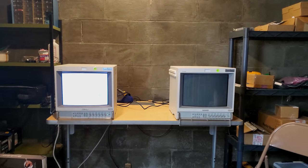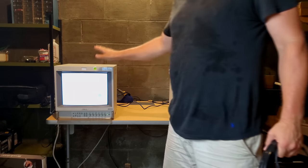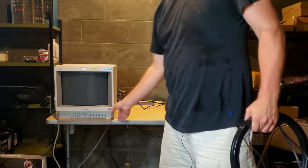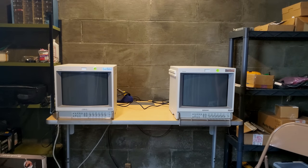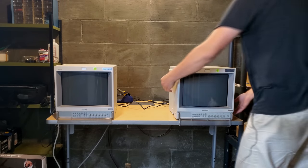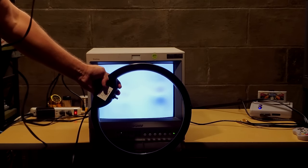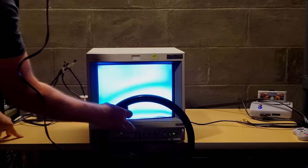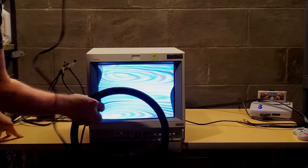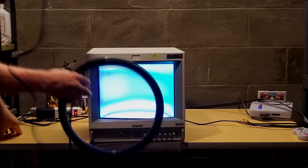What I'm going to attempt to do now is use my professional degaussing tool. I'm going to do it one at a time on these monitors — each one of them single. I'll show you how this works and hopefully this will clear up. I've turned down the lighting on purpose so you can just see the CRT tube mostly. In front of it, I'm holding this degaussing coil. What it does is it just creates a magnetic ring of interference. Look what it does to the screen when I'm up close — it really flushes the degauss. You see how it just moves all that discoloration around. That's actually a good sign — the fact that I can move the discoloration around so much.